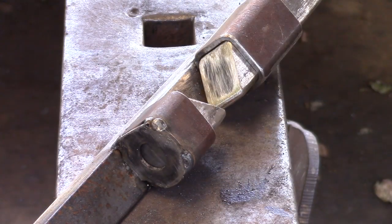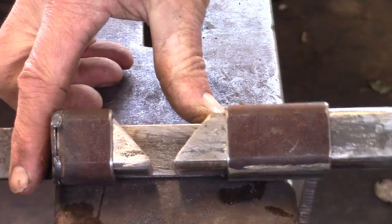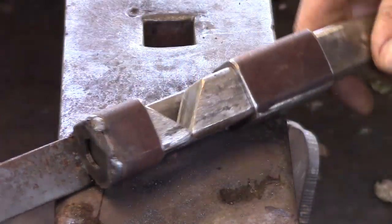In reality I make two of these guillotines — one with the angled or butcher dies and one with flat dies. That way I can swap the whole thing out when I'm going from cutting the tenon to actually drawing it out.